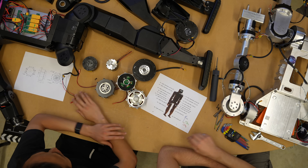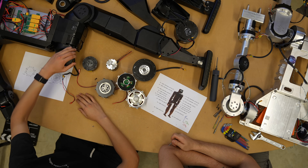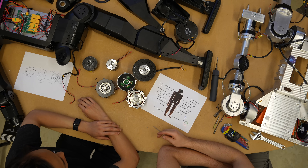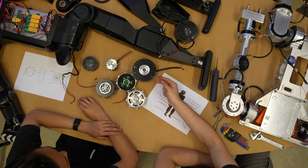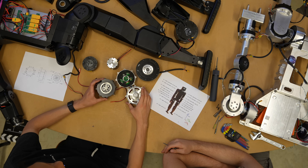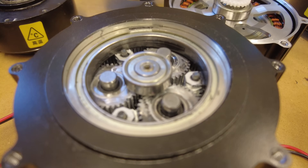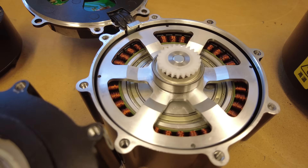That was most of the robot taken apart — the limbs and the torso. Let's talk about the actuators, a really important part of the robot. Laid out in front of us are all four styles of actuators we're using: the RobStride 03, 02, 04, and 00. They're all planetary gearboxes and QDD — quasi-direct drive — actuators, with very low gear ratios all under 10 to 1.